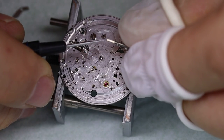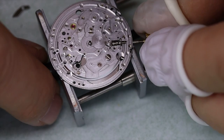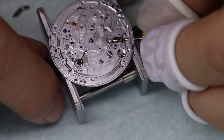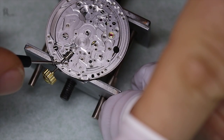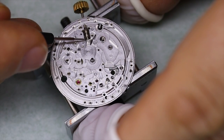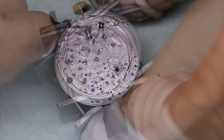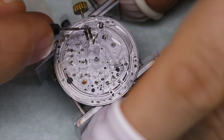An interesting little point here: the winding stem is actually hollow, and you may have seen that sliding pinion fit onto this little rod. The stem then fits onto it too - a bit more complicated than necessary, and I don't really see the big benefit of it.